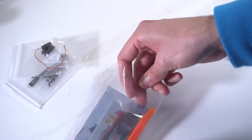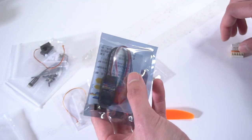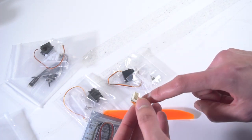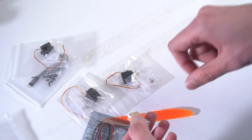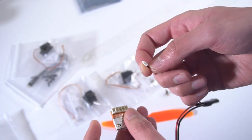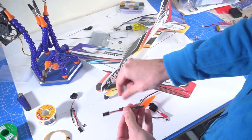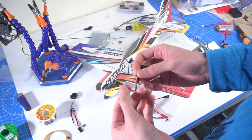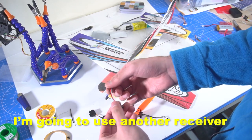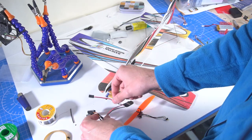Here we have the motor, servos, propeller, and the ESC. I'm going to take a look at the ESC first, and by the way I have here the receiver I'm going to be using. This receiver should be compatible with all the connectors from our servos and the ESC — and it is not compatible. So I'll have to make some modifications. I have soldered all the connectors to the servos and the ESC, so now we have the normal JST connectors for each servo and for the ESC as well. These wires are a little bit thicker and heavier but that's not going to be a problem — it's just a few grams, maybe 2 grams or something like that.